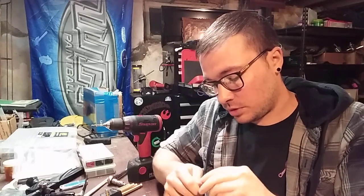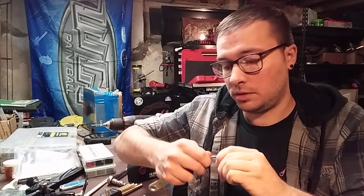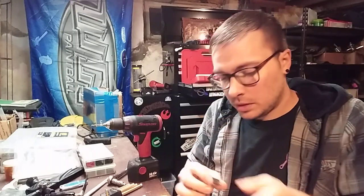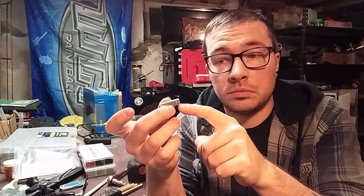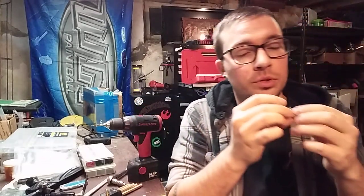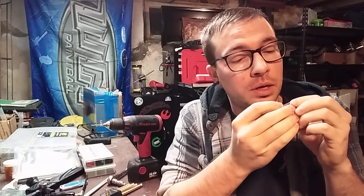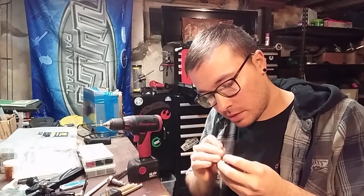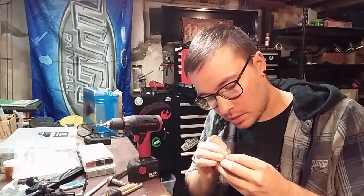So we're just going to chase this real quick — just quick and dirty by hand, a little at a time — making sure we've got those extra couple of threads so that I can really fully seat the barb in this. That's more than enough. Now that we've removed our piston, we have a 6-32 thread hole on the bottom where our barb was, and we have another one of those holes where our barb is going. We're going to blow the living crap out of this.